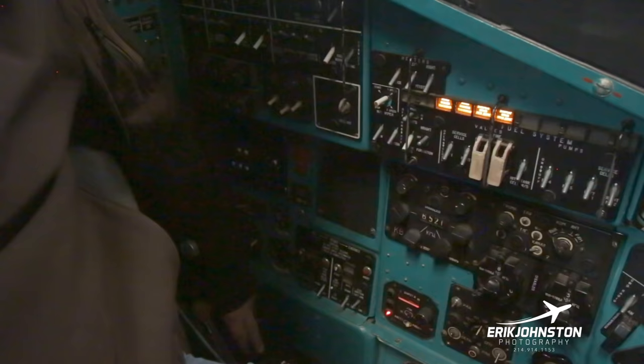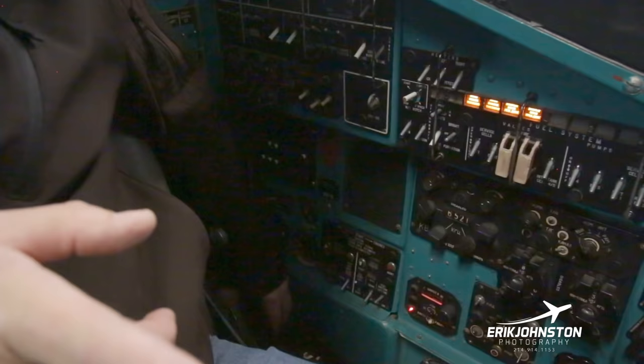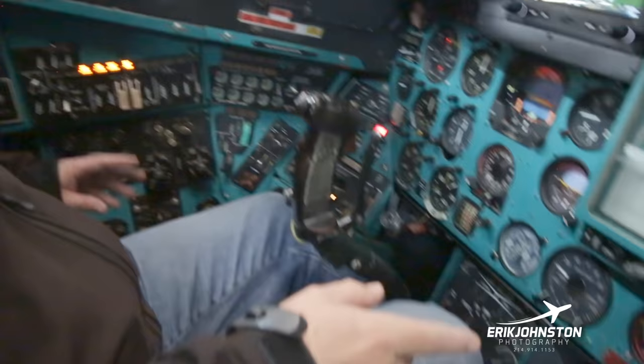I've got my cocks closed. So I've got all the fuel gauges and fuel cocks closed. So I'm not doing anything here. But now I've introduced power. At that point, or I've introduced fuel, excuse me. At that point in time, now my attention is looking. As soon as I get heat, I know I've got an ignition. As soon as I got an ignition, I need to start moving over to the pressure and temp gauges. So that's kind of the rough, without me looking at the checklist, that's kind of a rough idea of how you start the aircraft.